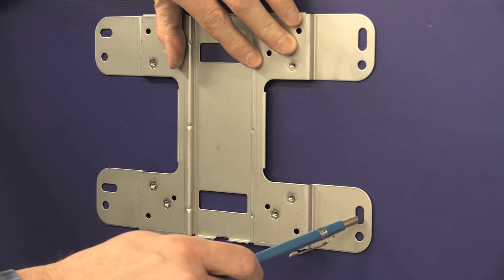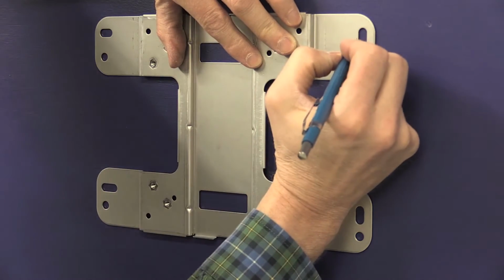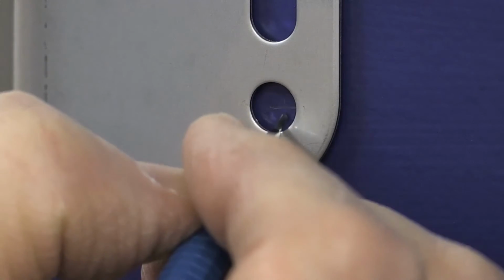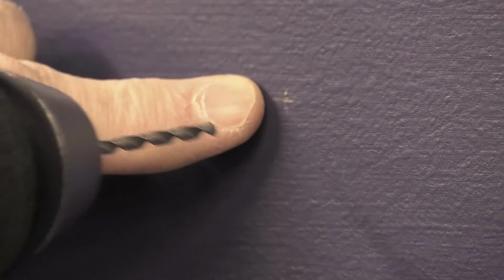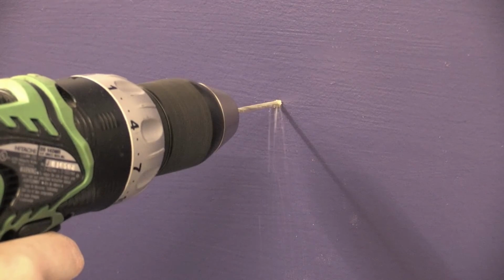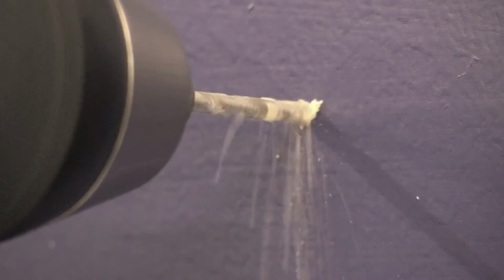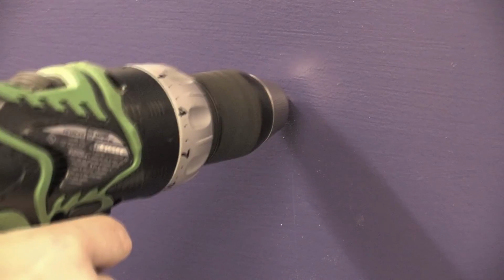For mounting the AP to a wall, the H or wall bracket provides 8 attachment cuts, but only 4, 1 in each corner, are required. Using the bracket as a template, place it where desired and mark the 4 hole centers to be used. If using wood or sheet metal screws, the drill bit should be the same diameter as the solid center portion of the screw, and the threads will extend past the drill on both sides. These screws must be provided by the installer. After selecting the proper drill bit size, drill perpendicular to the surface in the center of the marks. For masonry installations, please see the installation guide.